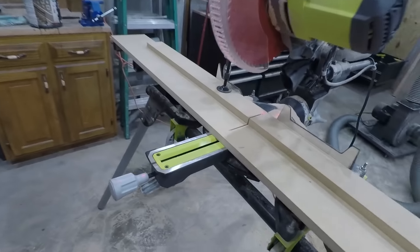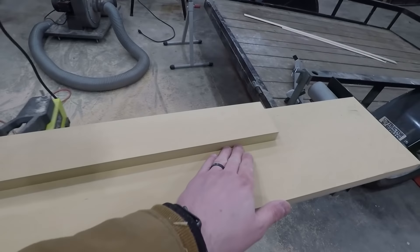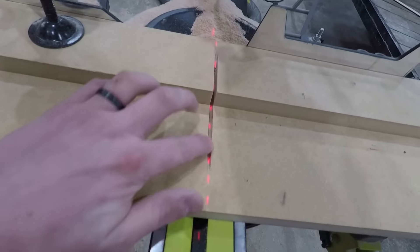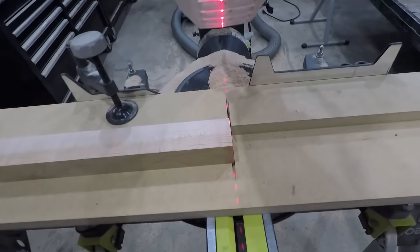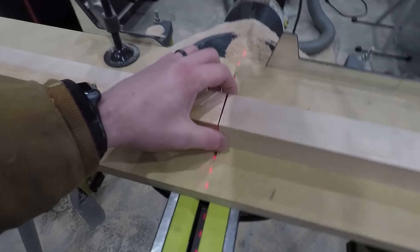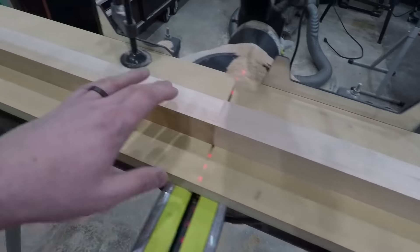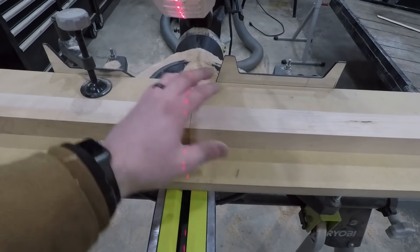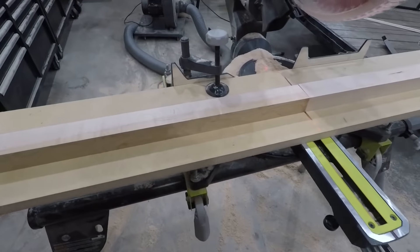I came up with a little solution that worked. I have this piece of MDF with a backstop — I made sure it's perfectly straight and flat. I set my saw so it won't cut through it, so this is still solid here. I take the piece that's on the left of the cut and put it on the left of the blade, then take the piece on the right of the cut and put it on the right of the blade. You can see when they're butted together there's a gap, so I clamp down one and hold the other and make a cut. It doesn't even matter if the blade is 90 degrees because I'm cutting them both at the same time — they'll just slide together. I have to do that for every butt joint cut on this island.